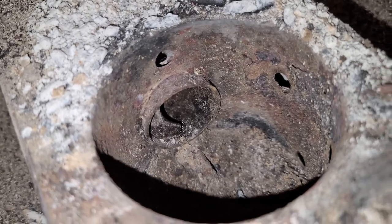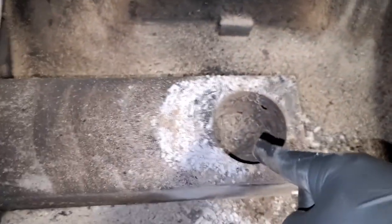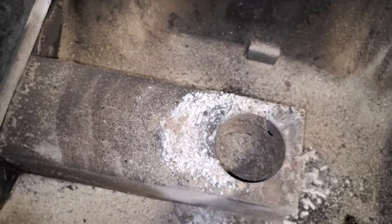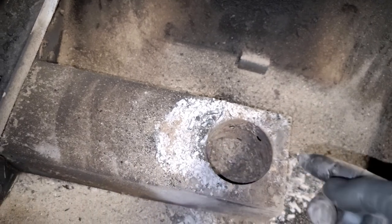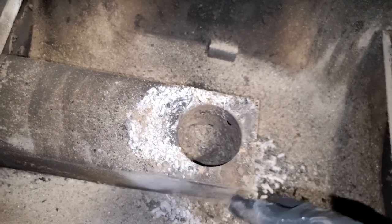The heat rod doesn't look too bad — I've replaced that twice. I've also replaced that little piece a couple of times and it looks like it's in decent condition, but I can definitely see there is some toasty love up in there. You can see where it was burning — I think that's from the soot in the bottom of the can. I emptied this out and see this real fine dust here — that's the culprit. That's what gets caught up in your auger and makes a whole mess out of everything.